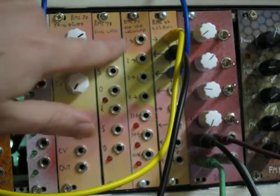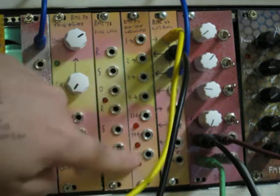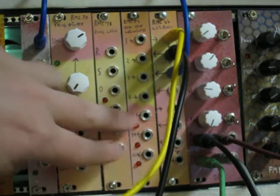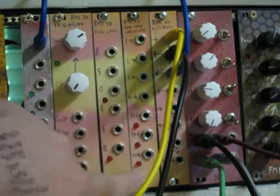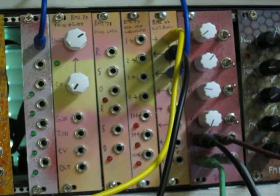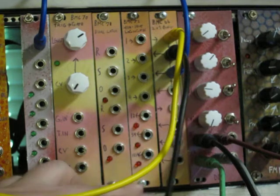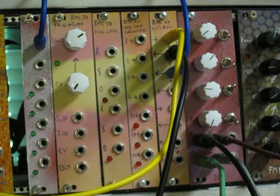And so you have inputs 1 and 2 that go to output 1, 2, inputs 3, 4 go to output 3, 4, and then the summation of these two outputs goes to the output all, which for ANDs and ORs, that works pretty logically. But with your NORs and XNORs and things like that, it can sometimes be a little bit strange that this will not be on when maybe it seems like it should.